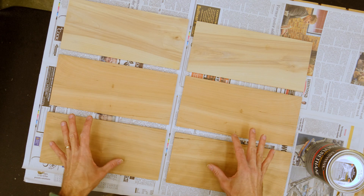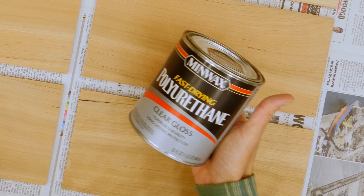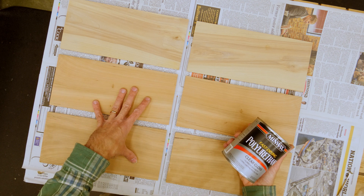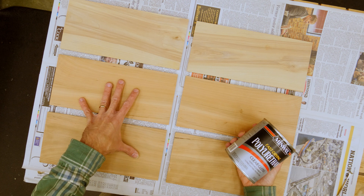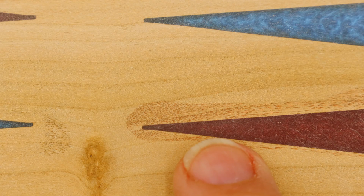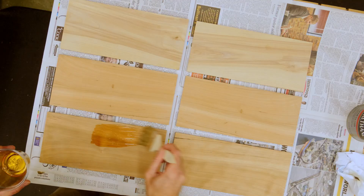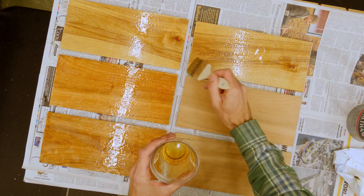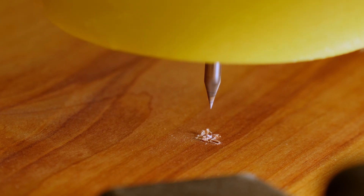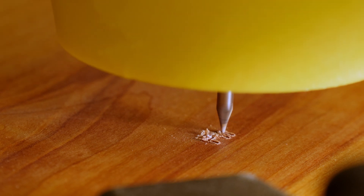This side of the boards will be the outside of the box when the piece is finished. I sanded it up nice and clean and I'm going to apply a clear finish before I do anything else - a fast drying polyurethane. If I were doing a project like this again with epoxy inlay I would do this step before anything else: get the wood milled to size, sand it down and immediately put a clear sealer on it to prevent epoxy from penetrating into the wood, because that can sometimes carry some pigment with it and create a problem that has to be sanded out. After applying a fairly generous coat of polyurethane and letting it soak in for about five minutes, I'm wiping it down lightly with a cloth. Now I'll engrave the text using a 30 degree engraving bit, running the engraving pass twice to clean up the edges as much as possible.